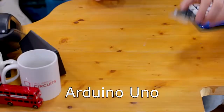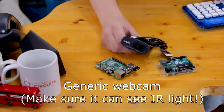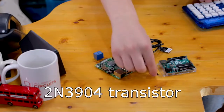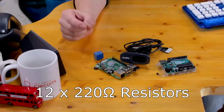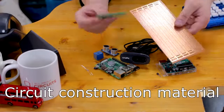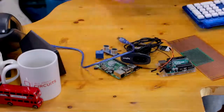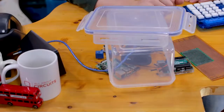For this project you will need an Arduino Uno, a Raspberry Pi 3 Model B, a generic webcam, a 5-volt relay, a 2N3904 BJT transistor, 12 IR LEDs, 12 220-ohm resistors, one 1k-ohm resistor, an ultrasonic module, some circuit construction materials, various cables for connecting modules, circuits and the Arduino together, and a waterproof box so that all this can be mounted inside.